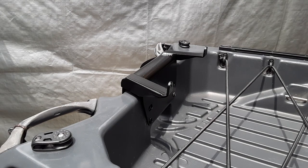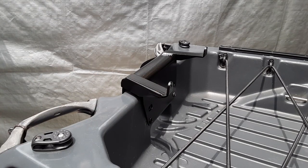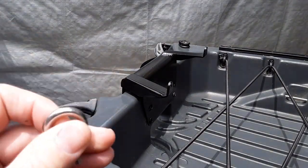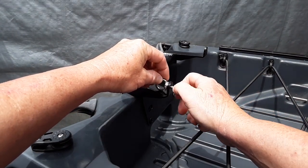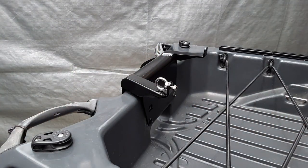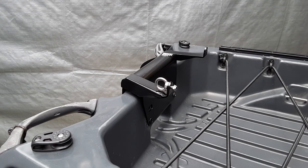This is a view of the outboard motor mount. As you can see, there are these tabs here and they have holes in them already — that's so you can run the control lines for the handle steering for this Bass 100. What I'm going to do is use these stainless steel M6 loops as guides for my control lines. I'll put it through the hole here and tighten down the lock nut, and that's what I'm going to use to guide my steering lines to this pulley that I've already installed.